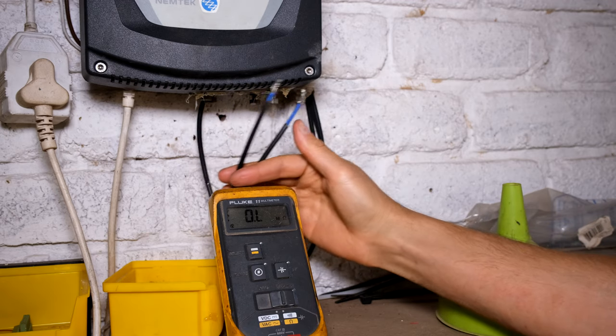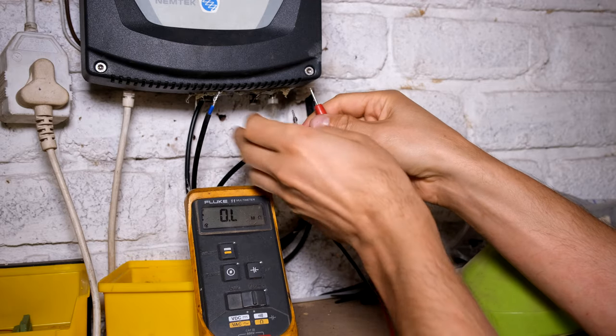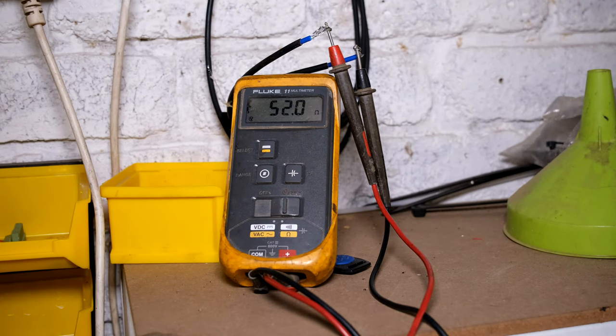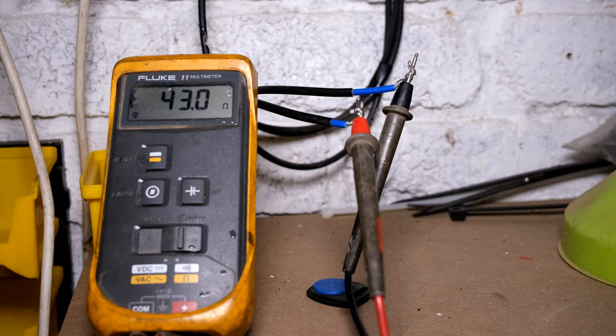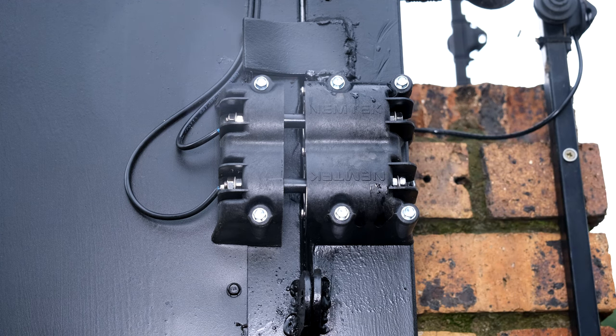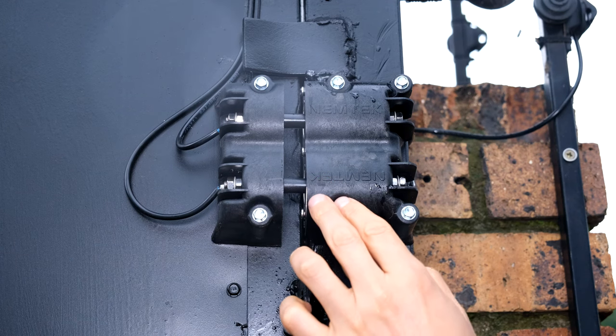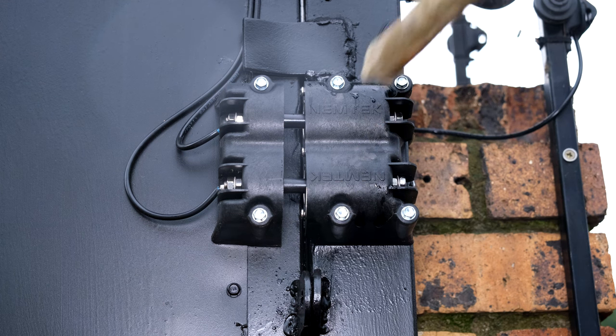Over here I have my energizer - it's off. These are the two wires: the live and the return. I'm going to show you the resistance. There you can see the total resistance of my fence is 52 ohms. Now when I open the gate, that should go down, because the gate is a series connected resistor. So I'm now opening the gate - the gate is open and I'm measuring 43 ohms. Just a note: there's a spring behind those two discs that don't always make good conductivity when measuring resistance. All you need to do is just tap it so the springs seat nicely onto the disc. Keeping in mind that when the energizer is on, this makes no difference.